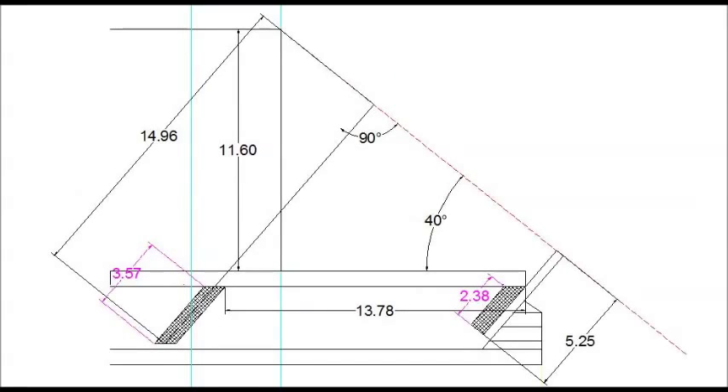I spaced the top platform three inches from the ground board and then drew in the south bearing. Its radius doesn't really matter because it's not driven, but it needs to be a little bit shorter than the north bearing. Also, the sag on each of these curves needs to be enough so that the bearing width is equal to or maybe slightly greater than the width of the platform where it attaches.